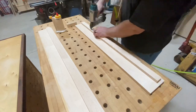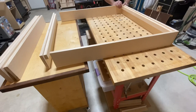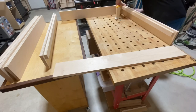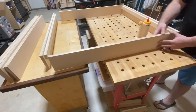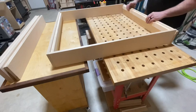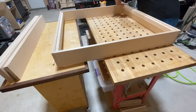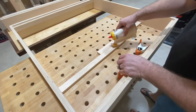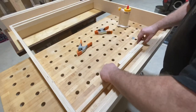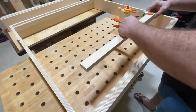Now you see me using these spacer blocks again. Glue and brads is all I'm using, and now you can see I'm going to join the first frame together. To the left and right there is that support piece that's going to hold all those slats. Everything's just going together with glue and brads, and I'm going to use a few occasional screws here or there, but once the glue dries that's pretty much all the strength you're going to need. I'm going to take some elongated pieces of three-quarter inch plywood and push them into the edges along with the pieces glued together.